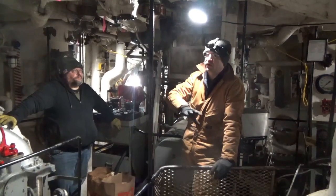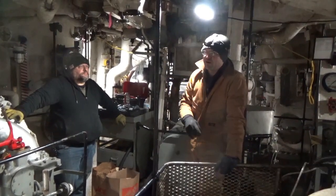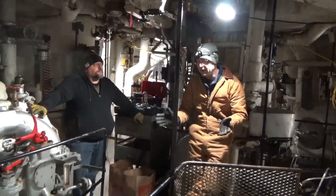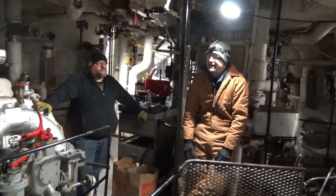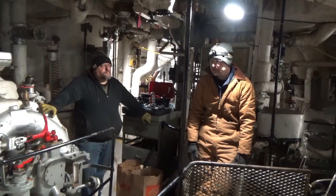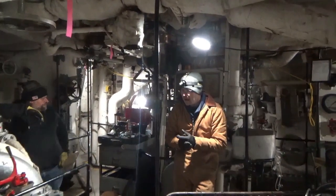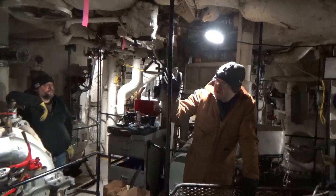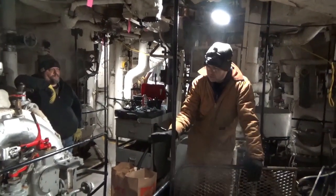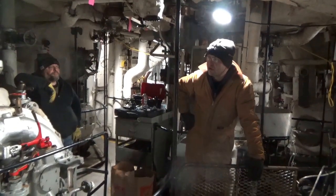The possibility that during all the time we spent behind that board and behind the covers, there could still be something across two of the bars. The whole space was flooded. We've tested several times, the phases are all good. But you put 480 volts and things can become conductive even if they're not normally conductive — there could be a twig, there could be a stick. The tests have continued to show satisfactory, and the AC bus tie is holding voltage well. After we're done today, the only sign of life should be the three ground fault detector lights — those three should turn on.